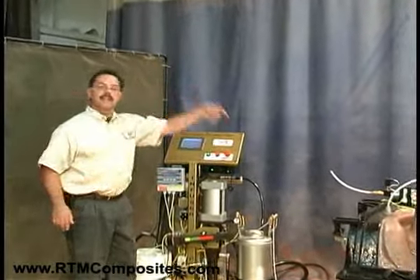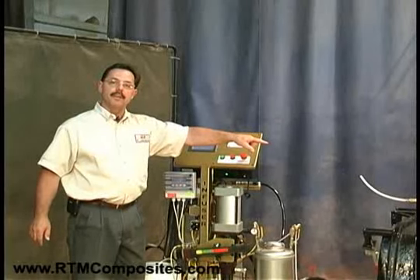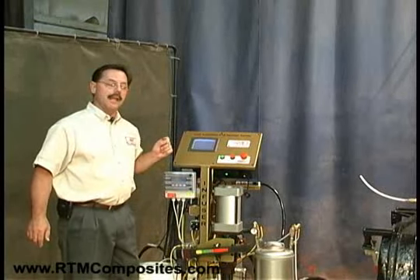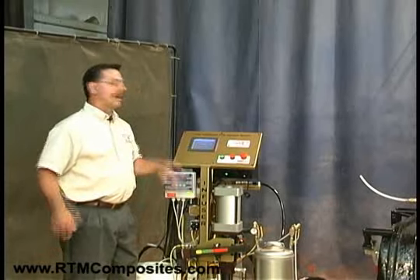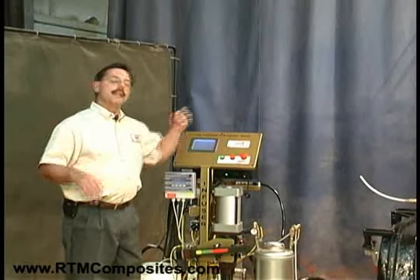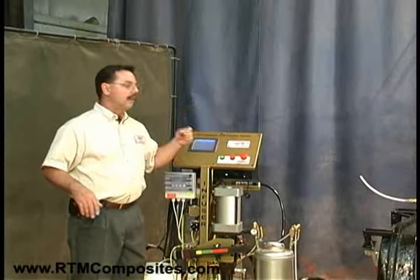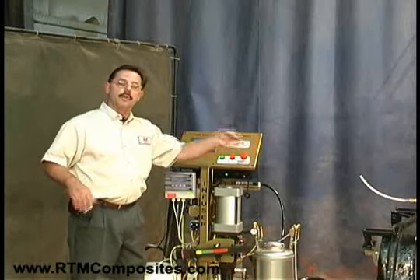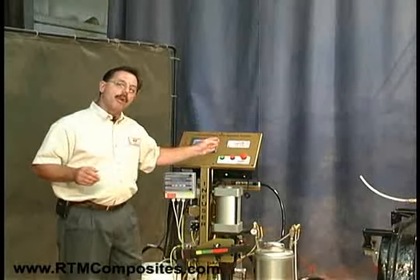When the PRG antenna sees that tag, it's going to go into its memory and select the sync base and recipe. So when I hit Start with that tag on the reader, that's exactly what's going to happen. All I do is hit Return, and that is held in memory. That's just how easy it is to associate or teach a tag to know which mold it's to go to.